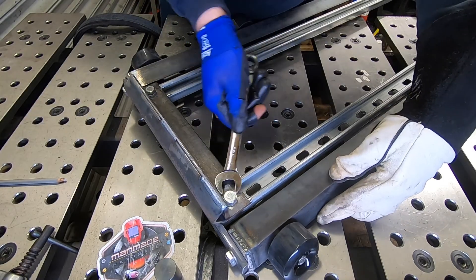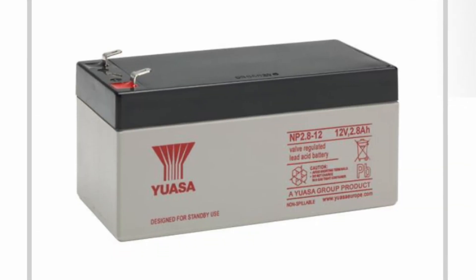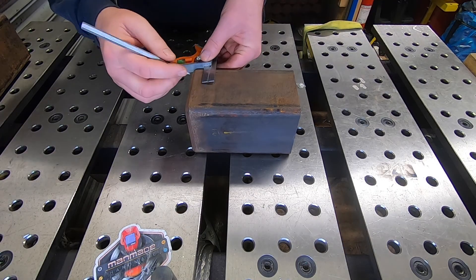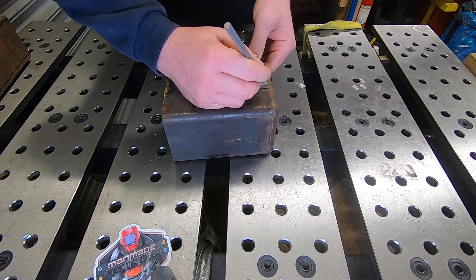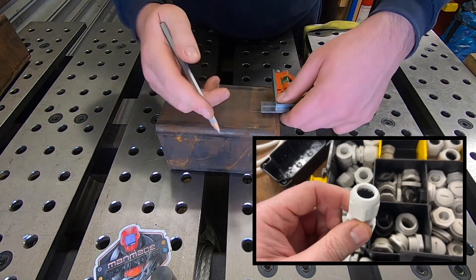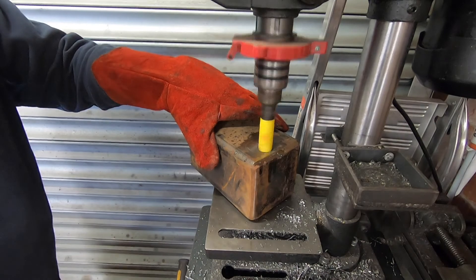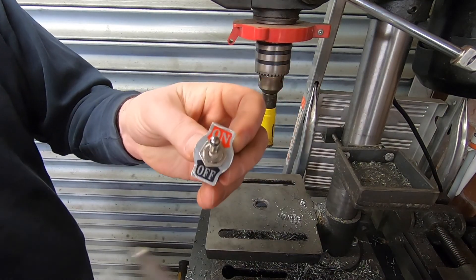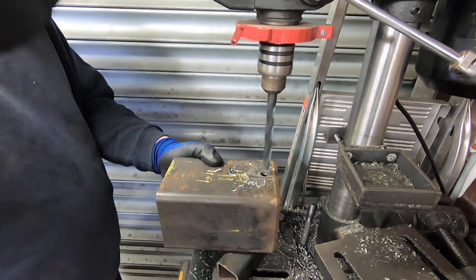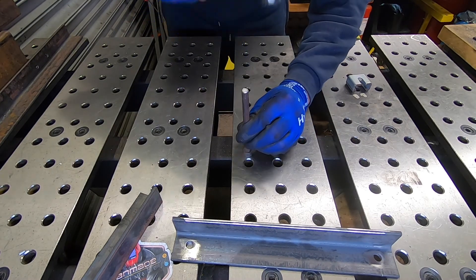That just bolts onto the front of the chassis here, easily replaced if it gets damaged. Of course a light or lamp needs a battery and the battery is going to need some protection too. So we're going to use this off cut of 100mm by 100mm box section to do that. I'm just marking up this box section for some holes. The holes are for a stuffing gland where the cable will break out of the battery compartment and also a little switch as well so we can switch the light on and off. To stop the battery from falling out the back of the battery compartment I've fabricated a little pin which should keep it in place.